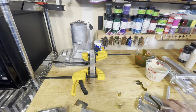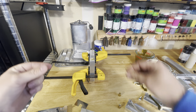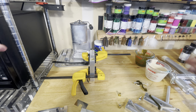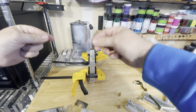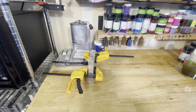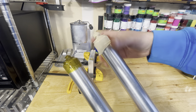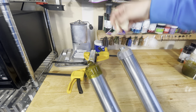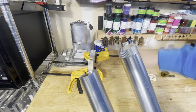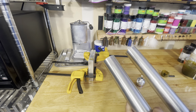If you don't have a C block, you can do a similar thing with the blending block. Instead of injecting with nice even pressure, you take the little handle off the top so you can move your injectors and just pulse them down — some people call it milking the cow. Just pulse your injectors and it'll give you a nice swirl pattern. I'll also show you how to clean the injectors: once it's cooled off, just peel the plastic off, pull the tip out of the injector, take your caps off, push your plugs up, and you're good to go.